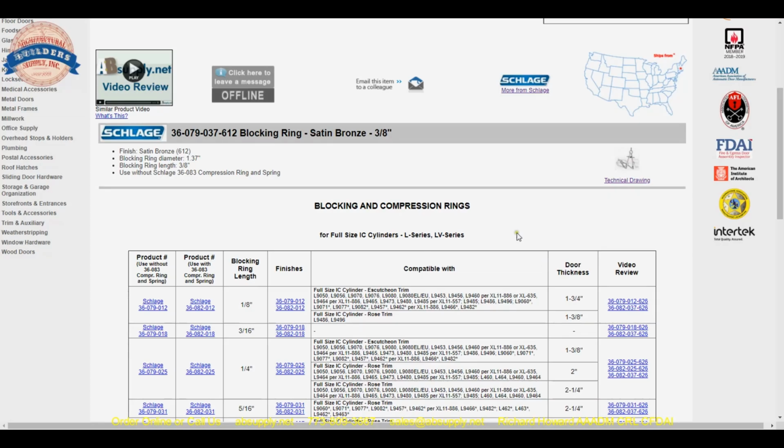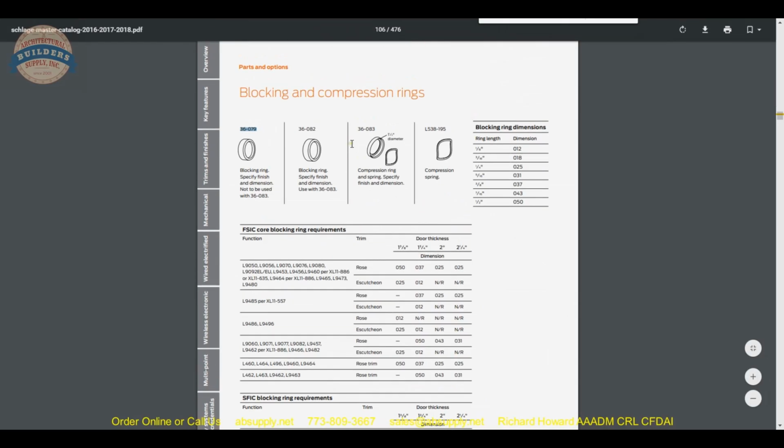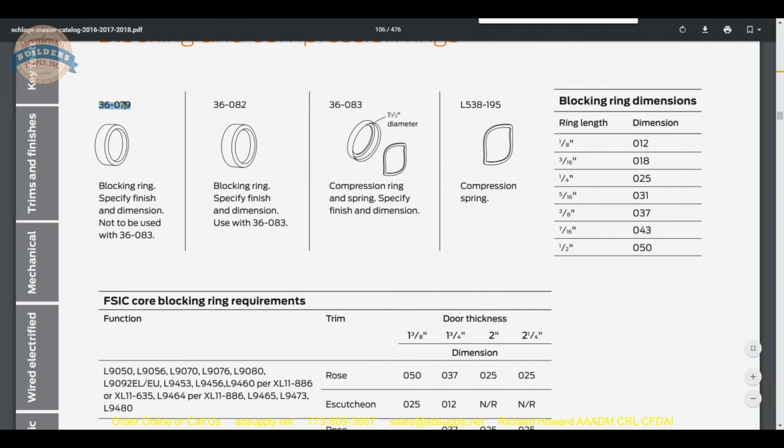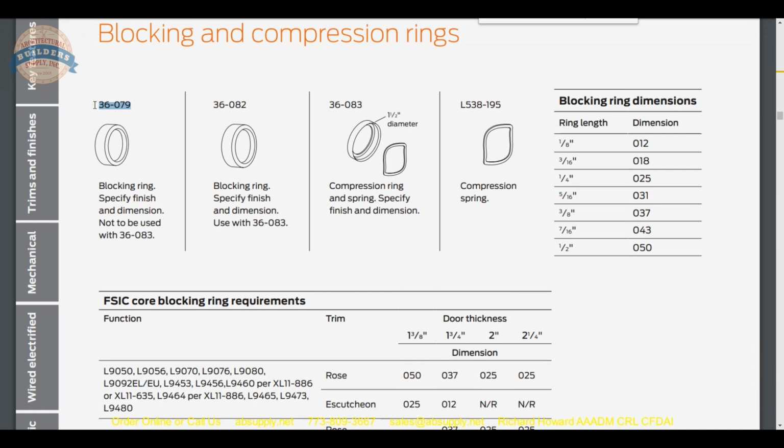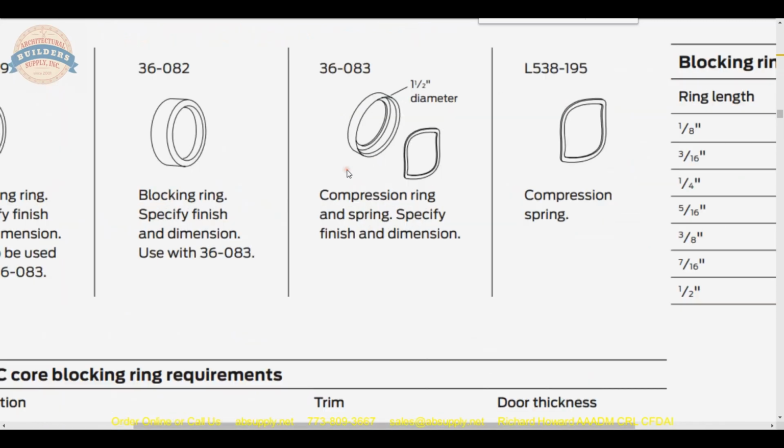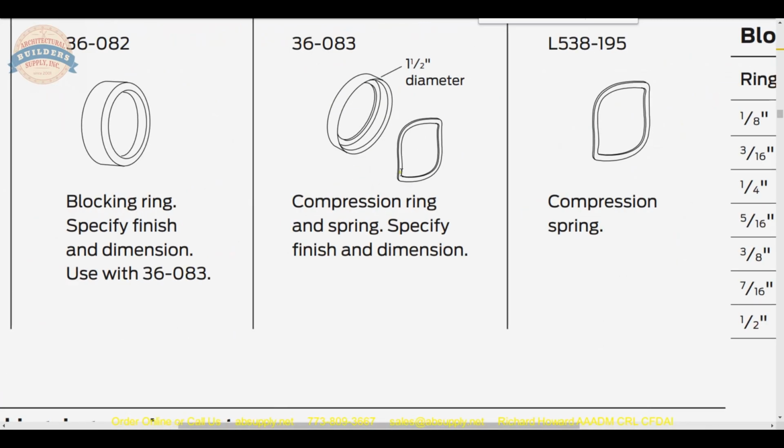There is also a link below this video to the cut sheet, which is this document showing the different blocking rings that they have. So this blocking ring is typically not used with the 36083. It's because it has a different diameter, different profile, and is used only as a blocking ring. So you could apply a blocking ring to the back of the 36083 compression ring and spring, which would be common in your typical mortise lock applications, and that's called a wave washer, by the way.